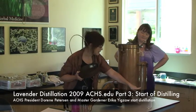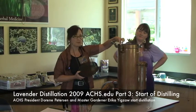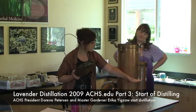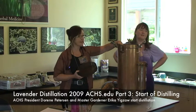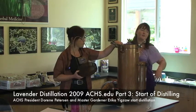So today we're just going to have water just a little way up our sight glass, and we really have to watch it because we don't want this to burn dry. There is an element in here, so if we need to, we can introduce water through this valve here. Whereas with rosemary, which I did last week, we were able to put water quite high up the sight glass — so it was a little bit different. This is the sight glass and it's going to show you the water level in the retort. That's the whole purpose of it — it has no other purpose except for telling us how high the water is.